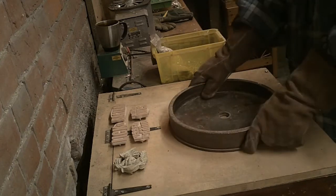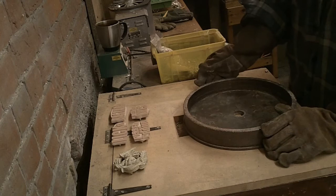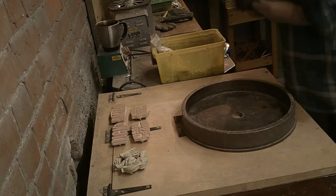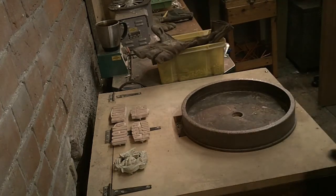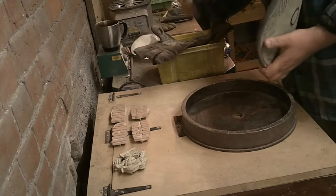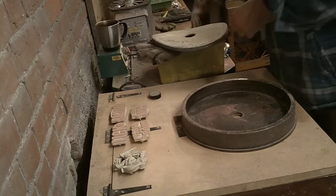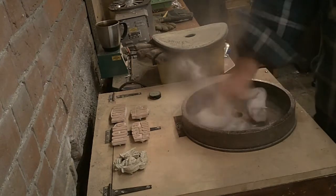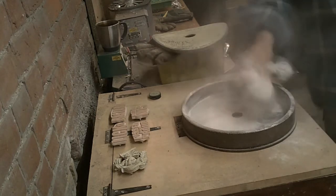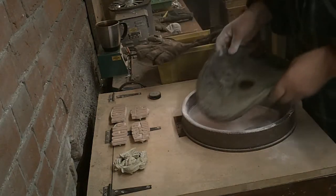The mould can here — a steel mould can — has been preheated to 150 degrees, ready to take these. I have to start now assembling the mould. I'm using black organic rubber. Again, these have been warmed through. The first thing to do is to dust the can — lots of talc. Put the first part of the rubber in.